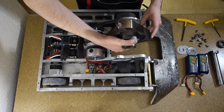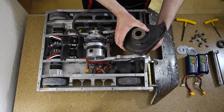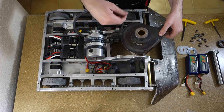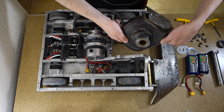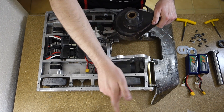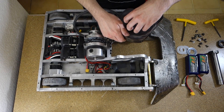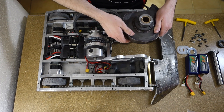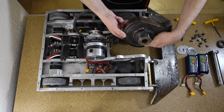Here's the weapons assembly. There's another McMaster tube here, but it was bored out custom because the IDs on these aren't very precise. There are one-inch oil-lite bushings pressed in so the entire length of the tube has bushings all the way down. When I hit somebody, it spreads the shock load across the entire length of the shaft, making it less likely to bend. Big shaft collars are on both sides — one half welded onto the blade, the other clamped onto the tube — which keeps stress off the weld, leaving just the torque from the pulley.